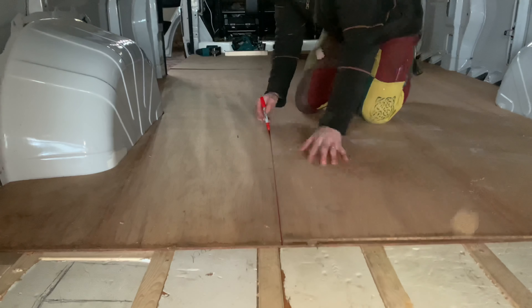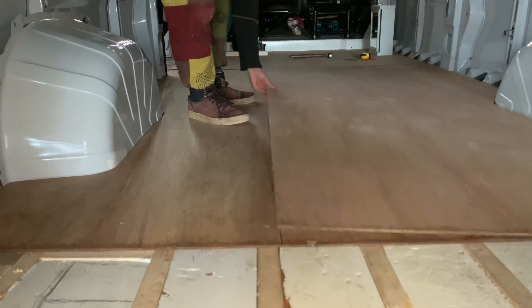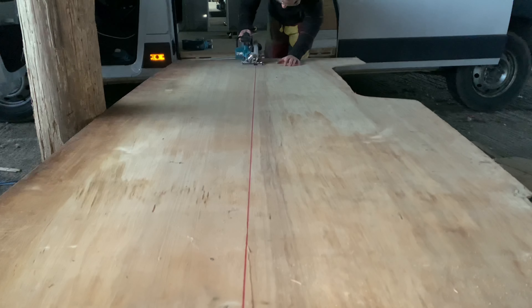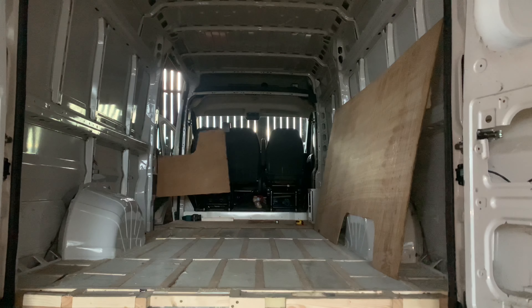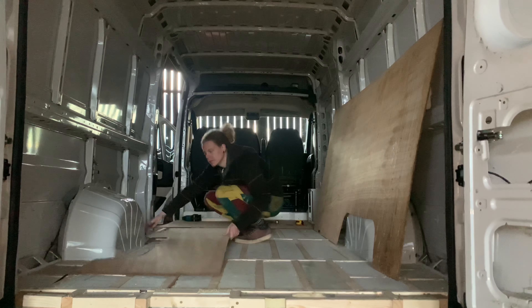I took my pen and went down the edge of one of them so I knew where I was cutting, lifted it up to see where the rough area was, then had a quick zip with the saw to cut it off. I brought everything back in to check that it was all square, level, and flat.